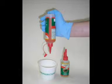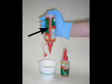Once the preparation is completed, we need to apply the Dry Fix wood stabiliser. Dry Fix is not a wood hardener and it needs to be brushed onto the surface of the timber and allowed to penetrate. It is most important that the moisture content of the timber is 18% or below. The Dry Fix bottles are calibrated and you use one calibration of the coloured liquid to one calibration of the hardener and mix thoroughly with a wooden spatula.